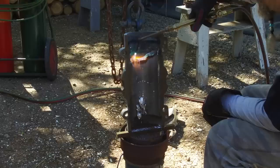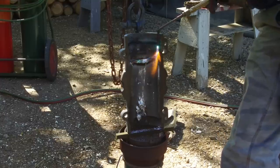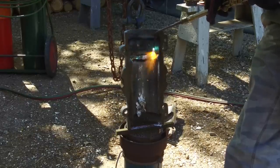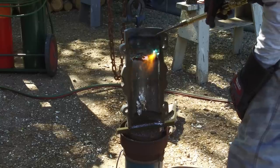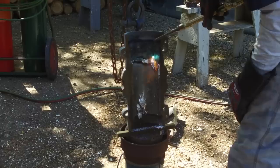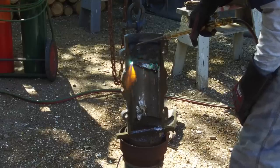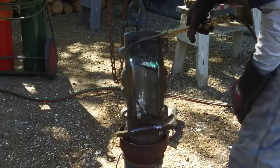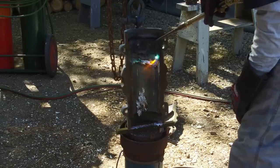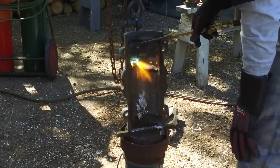By doing this right into the pot, it's going to give us an idea of how much Babbitt we'll need for this pour. We're going to make the ID smaller because we're going to bore it out in the lathe, so it will take a little bit more than we're actually taking out of here now — plus this actually is worn larger. This is really pretty nice; I've been given some bearings to pour in some pretty poor conditions and pretty dirty material, sometimes not even reusable.